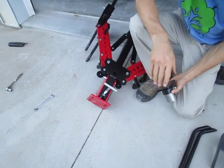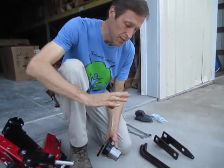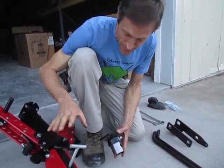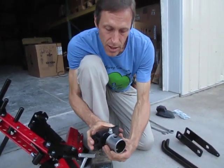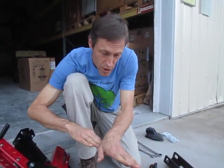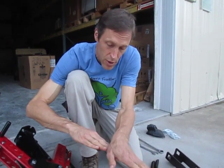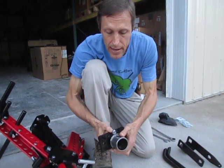You'll also be mounting this to a walk-behind tractor, probably using the quick coupling system. This is a special quick coupling we manufacture here that has a little bit of a swivel built in. That allows the cultivator a little bit of wiggle on the back so that if you're driving along and get a little crooked on the bed, you can steer the tractor back and the cultivator will follow. If this were rigid to the tractor, you couldn't steer it — turning the tractor would just slide the cultivator sideways. This is why trailers have hitches that pivot.